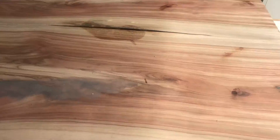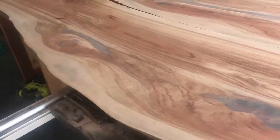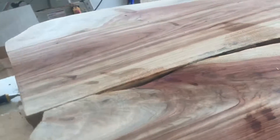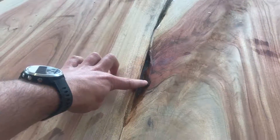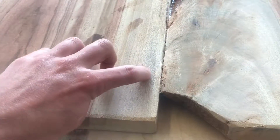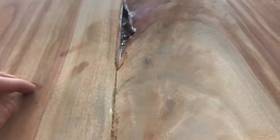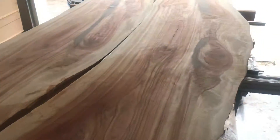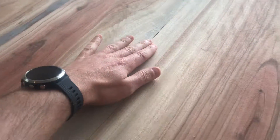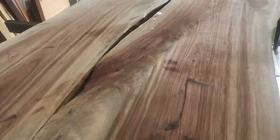The top is perfect, and the finish on the joint at one end is nice. The other end I wasn't delighted with — the river really falls off there so that's going to be all epoxy. There were a few cracks so I've just notched out a little bit there. The river is going to come the whole way through to the end of the timber, which is pretty much what it'll look like through the center. Happy with that. The plan now is to mix up the green epoxy and get it poured to the final level.